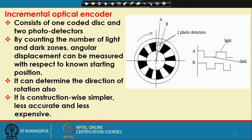We have already discussed the working principle of an absolute optical encoder. This absolute optical encoder is very precise, but the problem is the number of photodetectors must equal the number of concentric rings. If I use 10 concentric rings, I need 10 photodetectors, which are very costly. That is why absolute optical encoders are expensive, and in place of them, we use incremental optical encoders.